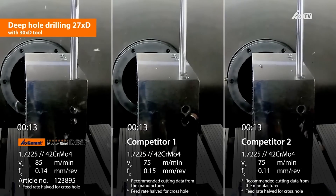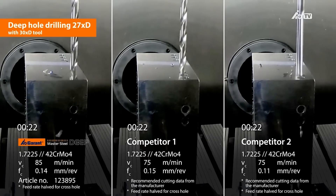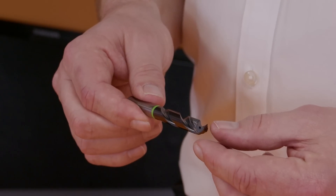30 times D — that does not sound like fun. We have a simple system and if you follow the procedure for setting up the pilot drills and the long series drills, we're pretty confident you will have no problems drilling. Are we pecking using these drills? No, on the longer series ones in conjunction with the pilot drill, you go straight into the hole and drill from solid straight through in one hit. That must make cycle times a lot quicker — because you're not going backwards and forwards. Yes, a lot reduced — because of the guide pads, the swarf evacuation, and zero pecking, there's a lot less chance of breakages or swarf getting in the way at the front of the drill.